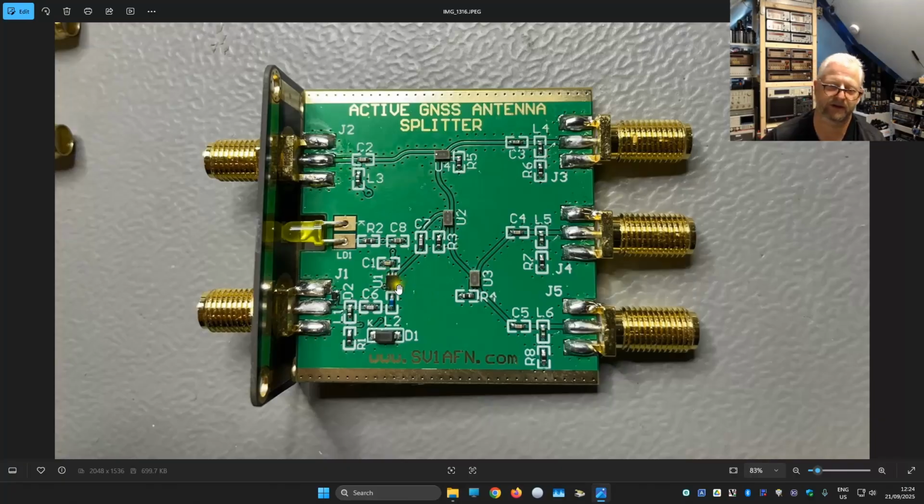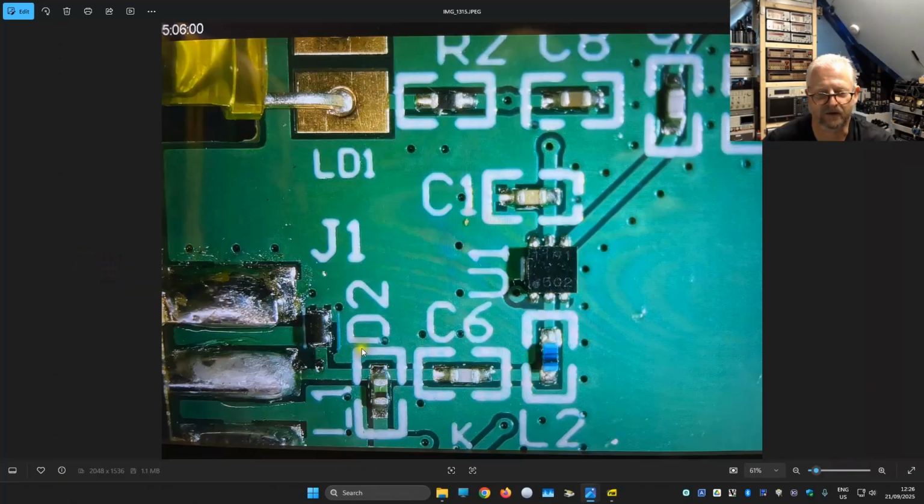So the main thing we need to look at here is the LNA chip that they use now, because why they think they don't need filtering, and they did do that in the V1. So closer look, indeed I don't see any filtering. I see indeed here a little diode, a DC decoupling, then a little coil, and here is the amplifier. And I think it says 1191.